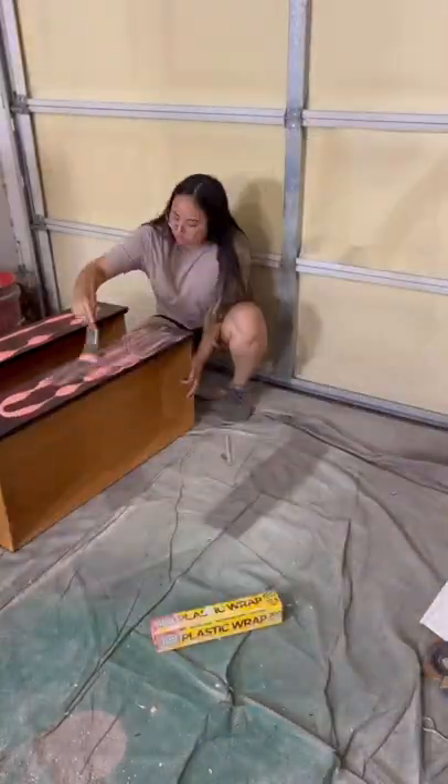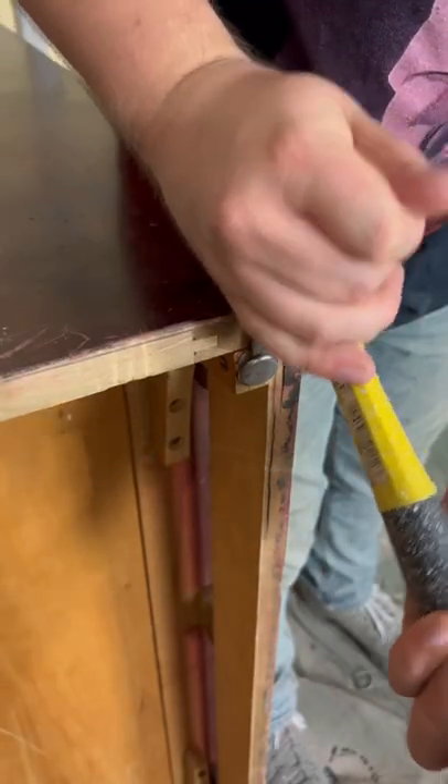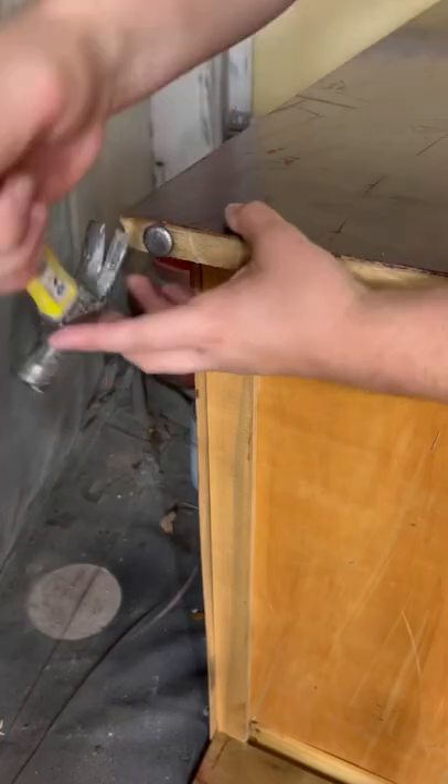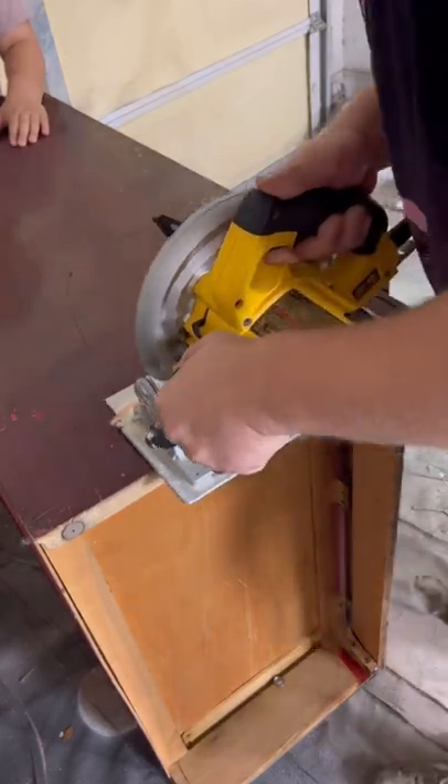For this piece we're going to be doing more of a restore than a refinish. Since I like the veneer on this piece a lot, we're going to be stripping it down all the way rather than painting it. We do that by adding an ample amount of citrus strip on each drawer and then wrapping it in saran wrap.